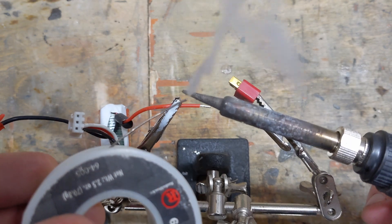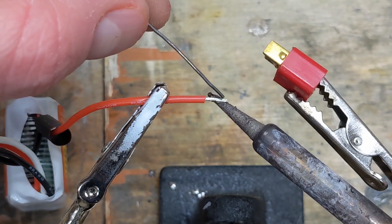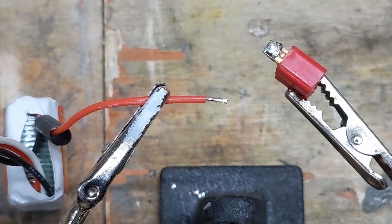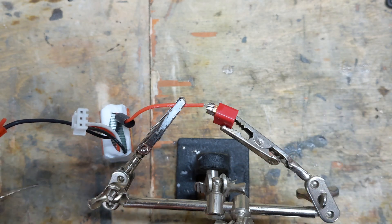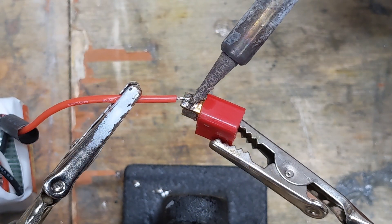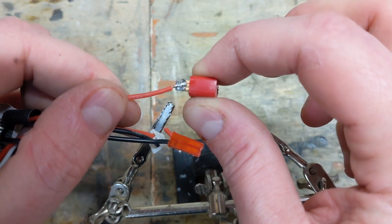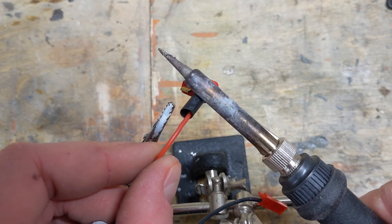Now it's time to tin the surfaces. My soldering iron is hot, so I take my solder and touch it to the iron to tin it. I now place the soldering iron on the exposed wire and touch the solder to the wire so it melts and flows into it. Then I touch the soldering iron to the connector terminal and again touch the solder to it so that it settles a bead on the surface. Now I just move the helping hand so that the wire is touching the terminal, then touch the soldering iron to the wire just until I see the solder melt and flow together. After a few seconds it cools enough to be solid again, and I can test the connection. This seems good, so now I slide my heat shrink up over the connection and wave the side of my soldering iron across the heat shrink until it shrinks enough to grab.